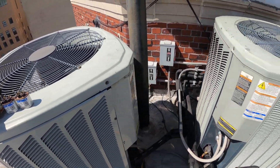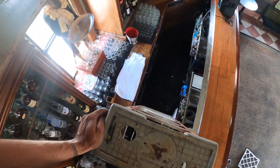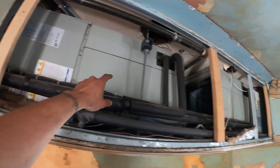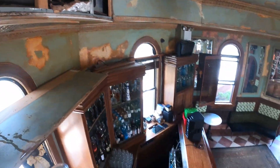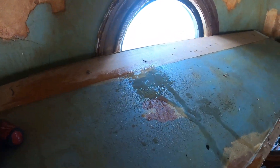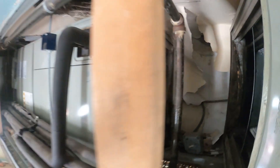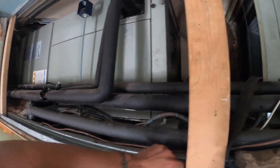I'm going to turn on the power and see what happens. So we got new capacitors, new contactors here now at the blowers — two blowers in the ceiling, super high up. You can see water's coming down. Just pulled out the filters; they were completely packed. If you look, there's a block of ice on that coil. This one's looking good, but this one is a block of ice.